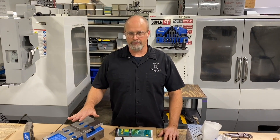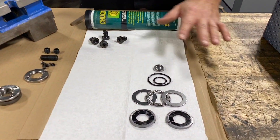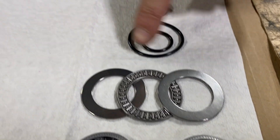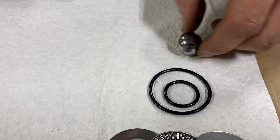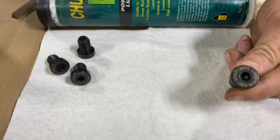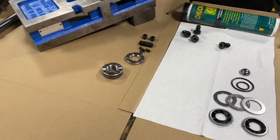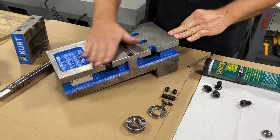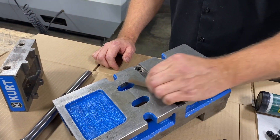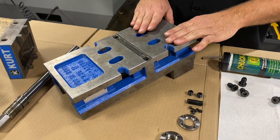After determining the exact model of this vise I was able to contact our supplier and get a nice rebuild kit, which supplies our new brush seals, thrust washer and thrust bearing, the two o-rings required, and the bearing for the movable jaw. I also ordered some new cap screws for our vise jaws. Now for a quick inspection on the vise itself — just like anytime we mount this onto the machine, I'll take a honing stone over this machined surface to make sure there are no nicks or burrs. Accuracy of our parts starts with the vise, and the foundation is the base.